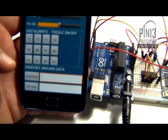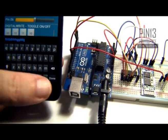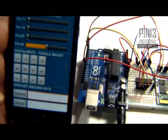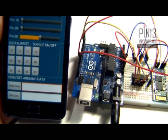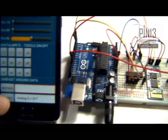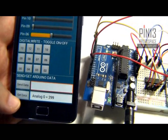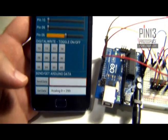Let's try send data. I don't have anything right now to test it with, but it's as simple as typing whatever information you want, and it sits in the text field until you're ready to press send. Arduino receives this and you can decide in your code what to do with it — display it on an LCD, control a motor or servo, and so on. Right now my sample Arduino code is wired to read analog pin 0. Since analog pin 0 is not connected to anything it's just reading ambient noise, but I can connect it to sensors, LDRs, whatever. And this is basically Androino in a nutshell. I plan to add more features in the future if there is really a need for such a tool.